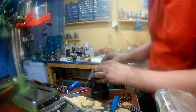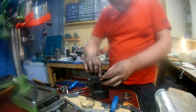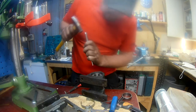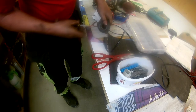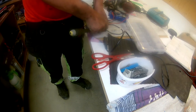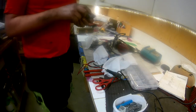One bearing ended up not being seated well because it came out when we took it apart. We had put it together to check for balance, and my dad ended up removing a little bit of material on one of the fan blades. Balance should be good enough. I had to redo that bearing that came out and add a slightly thicker feeler gauge in there.